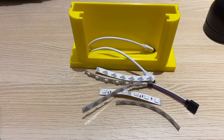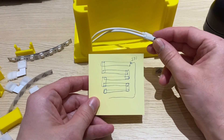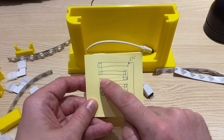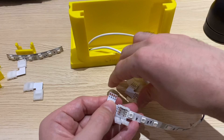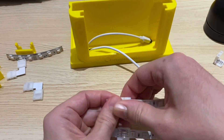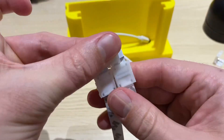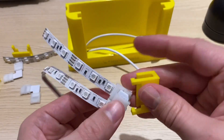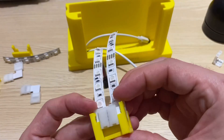We have our LED strips, corner connectors, and 3D printed clips. Here's the simple wiring plan: use the input cable to snake around the bottom and connect to the top of the strips, snaking down for five total LED strips. To make a 180-degree joint, remove one snap cover so two 90-degree joints combine, then snap all covers shut. For the folding sequence, fold the left and right halves inward, fold the top back to sandwich everything together, then slide the 3D printed yellow plastic clip over it to hold the connection and maintain proper LED spacing. That's the first two rows of the LED matrix.